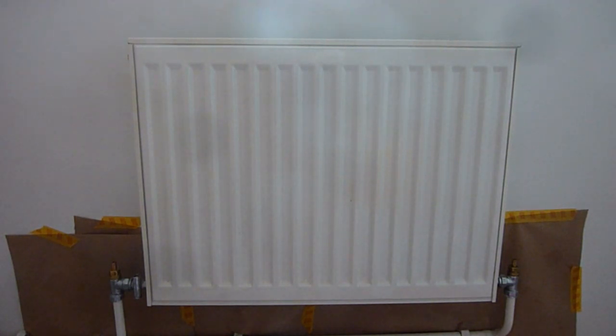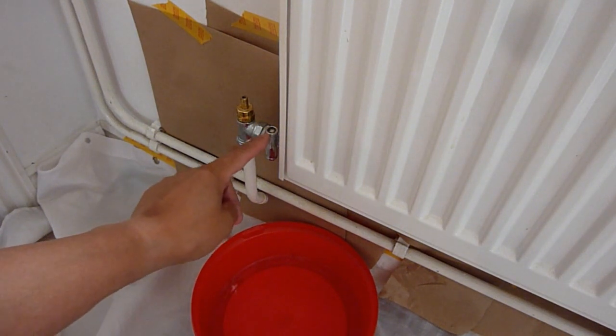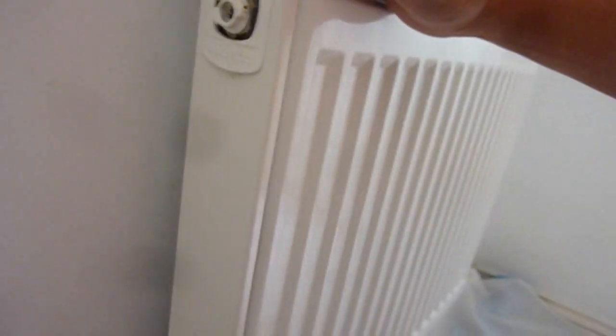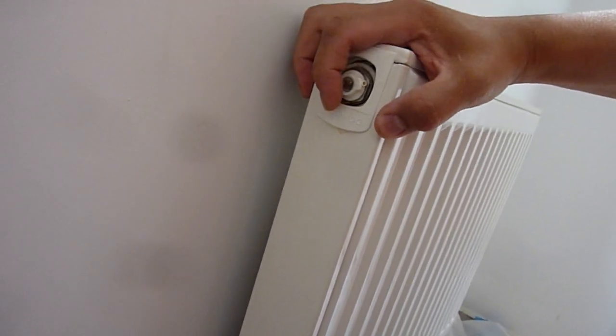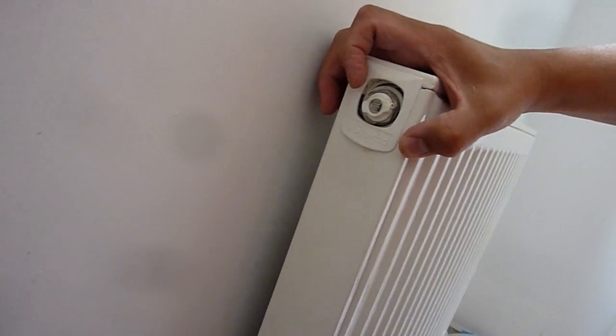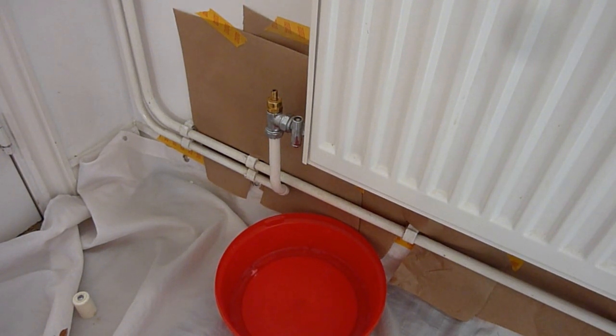The water is coming in here and coming out here. I've put masking paper all around because on a lot of radiators when you undo them, inside there's a lot of black metal oxide — probably iron oxide — that will stain and will never come out. So you've got to be very careful. I've noticed on these modern radiators it sometimes comes out as not black gunk or iron oxide, but I've masked it anyway. Next step: I need one of these keys — half a centimetre. I'll also need the adjustable spanner.